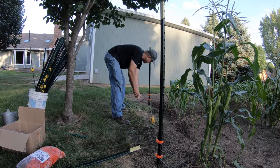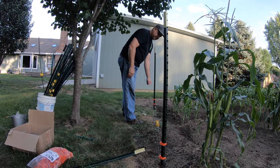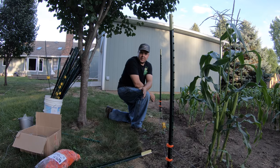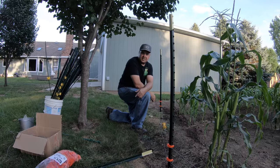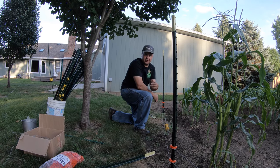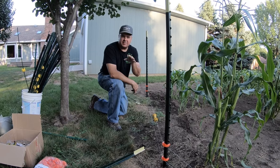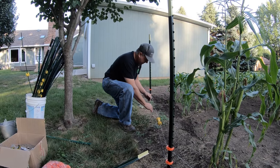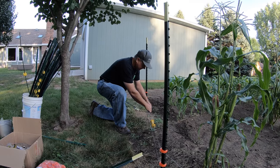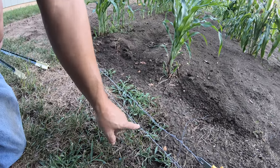This should be stretching the wire all the way around. It's nice to have this bottom one fairly tightly stretched. There's a type of electric fence called a high tensile fence — that's better for actual horses and things like that. For our situation, an amateur stretcher like me is fine. For this to work, it needs to be one continuous wire from our power supply to ground. I'm going to use that extra wire to tie the two wires together, because you want the current to flow through both wires from one source. Bottom wire tied to the top wire right there.